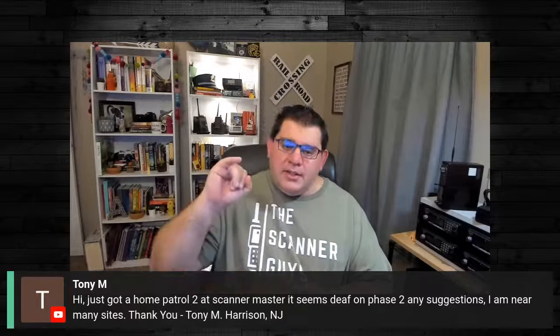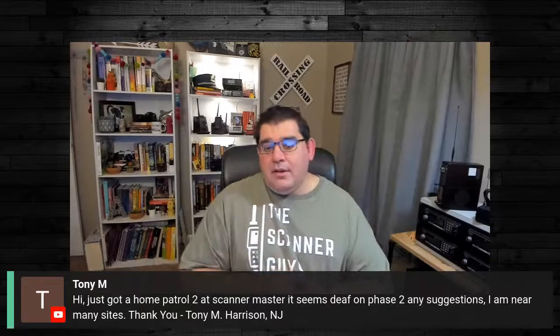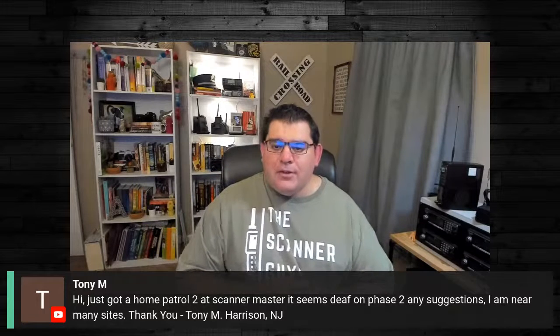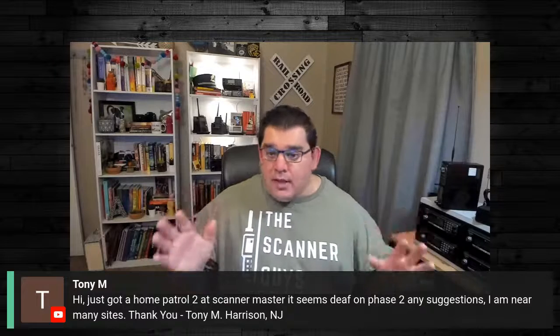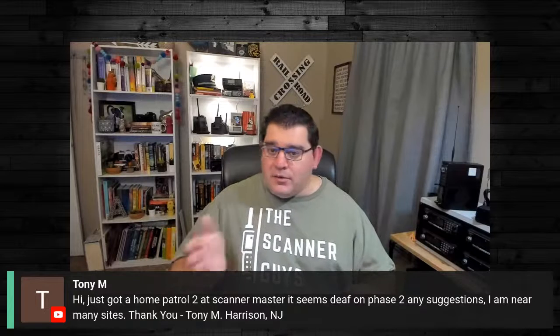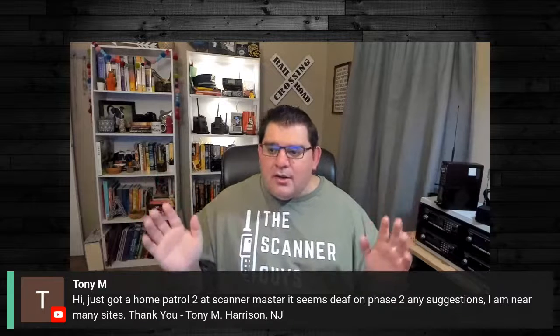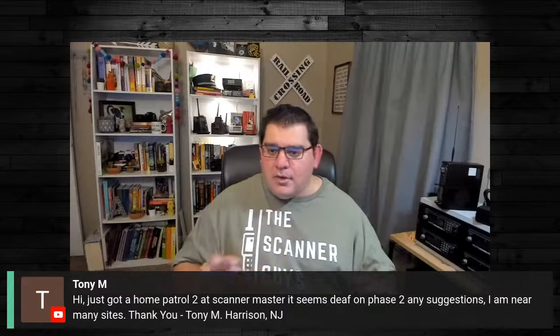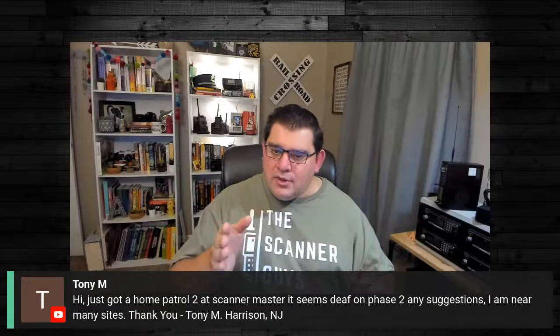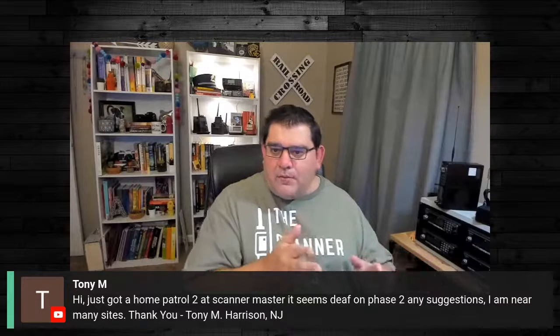The other thing to keep in mind on the Home Patrol 1 and 2, there's the attenuator button up on the top. Make sure you haven't activated that. When the Home Patrol 1 first came out, I fielded so many calls with, my scanner can't hear anything. I'm getting absolutely nothing. And the first place I went to is I asked them about the attenuator. Have you enabled that? Yeah, I turned it on. I don't get anything. Make sure you turn that off. You don't want the attenuator on. The other thing with those phase 2 digital systems, you may want to tighten up the squelch. Maybe do 3 or 4 for the number with the setting for the squelch.